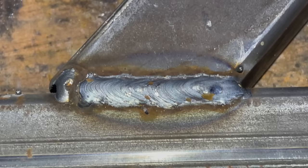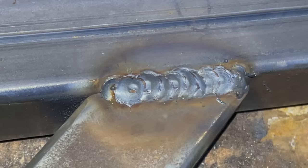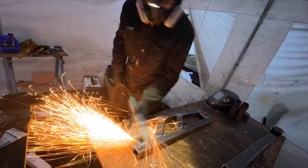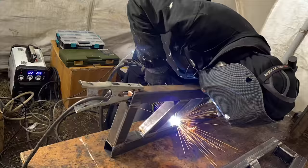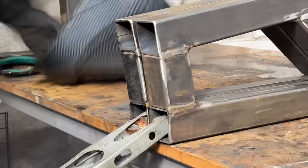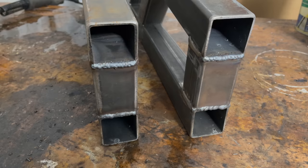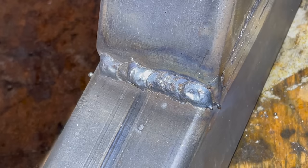Now for the welds, I tried my best and once again placed some solid welds, but sometimes the gap between two pieces was too big and here I had to place individual welds. After grinding down the welds on the sides of the two side pieces, I attempted to weld shut all the openings on the square tubes without putting too much effort into getting it absolutely watertight. Overall, I'm very happy with those latest welds, especially in the corner areas of the two side pieces as they can be quite narrow.